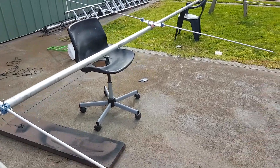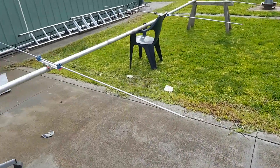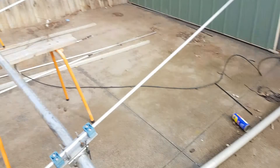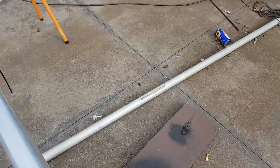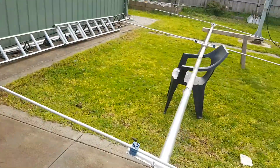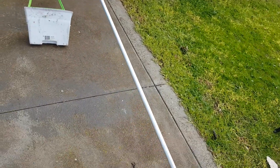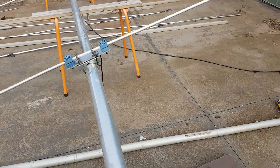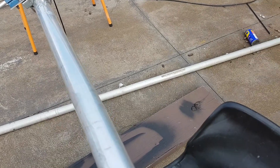I've got to check this for balance — this is going to be one of the key points for this antenna. It won't necessarily be the centre point. I'm going to try and pick it up now. It's a very big antenna. I can't pick up the end — I'm at the approximate middle. We'll move down the antenna to element number three and see if I can pick it up from here. I've got two ends up and this end's struggling, so we're almost at the centre point. The rest might be about here — yep, the whole antenna's in the air. So this looks like roughly approximately where my mounting point will be.